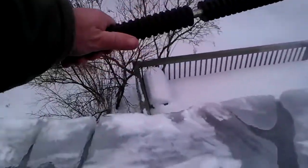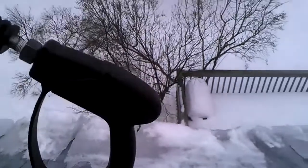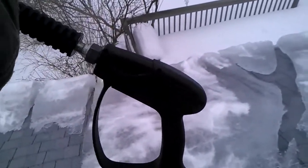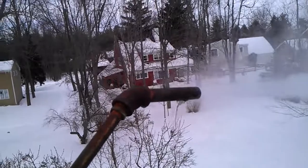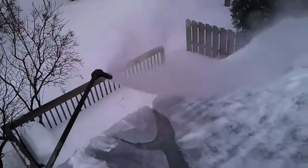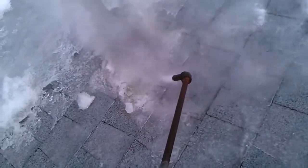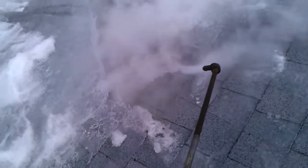The number one most important thing when you're looking for a low pressure steamer is to ask about the gun. As you can see here on our gun there's no trigger — we don't have to squeeze a trigger to control the flow of steam. The steam just constantly comes out of the end of the gun. The other thing you're looking for is a metal pipe on the end of the steamer. Everything you see coming out of that gun is steam except for the few drops of water produced. Steam can be placed safely and effectively right down to the roof — it will not cut through your shingles. We could literally hold the steam half a centimeter from the roof for 20 minutes in one spot and it will do no damage. Very low pressure — between 100 and 300 PSI — and temperatures of 250 degrees.